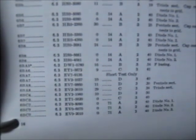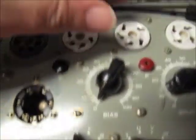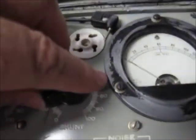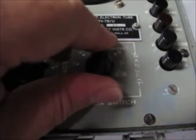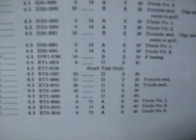There are further numbers we need to set for this particular valve. To the right you'll see there's a 9, a load of dashes, and a C. The 9 is referring to the bias you're going to apply to the tube to measure the GM, and the bias is this variable pot here — you can see it goes around to 100 and we're going to set it to approximately 9. The function switch in the right-hand corner lets you select the measurement type. We'll switch it to range C because that's what the book tells us, and we'll be pushing button 3, which is the GM mutual conductance, ensuring we get a figure of 41 or more.